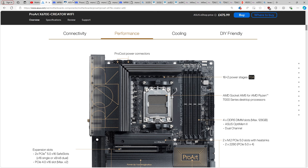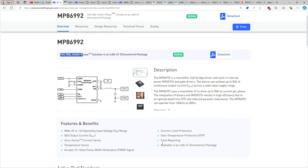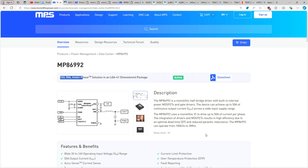I've been tempted to try swapping different power stages on a VRM to see which actually runs coolest, but the problem is they might not be configured correctly if you keep using the same controller. Monolithic Power Systems makes both power stages and controllers, and there might be proprietary functionality you only get using a matched MPS controller with MPS power stages. Same with International Rectifier and OnSemiconductor.